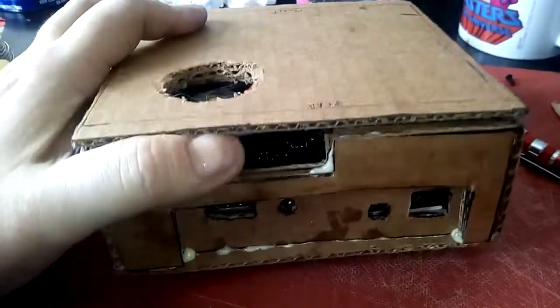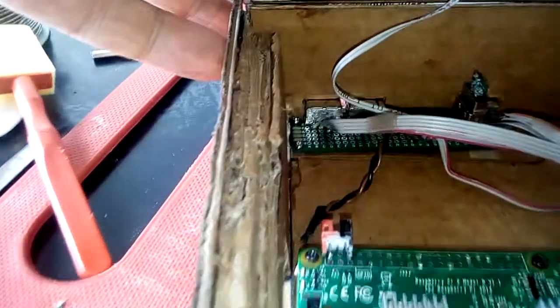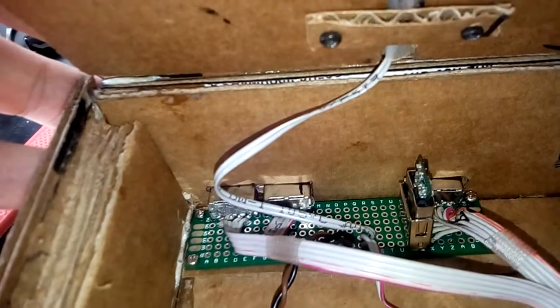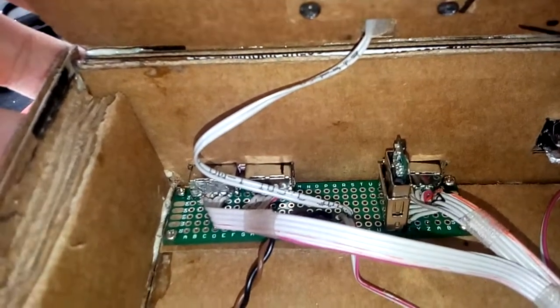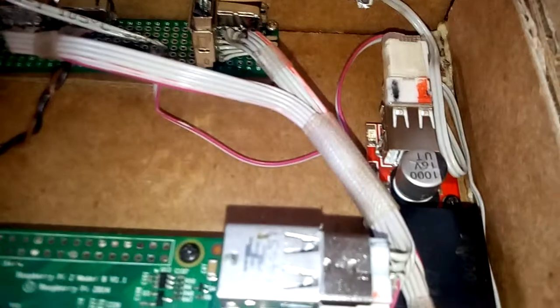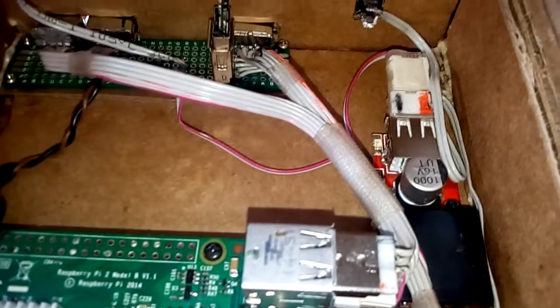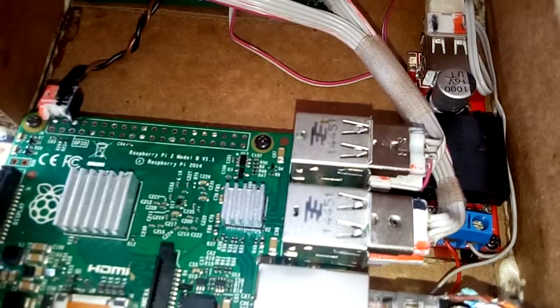I cut out the vent here. The reason being is there's a laptop fan in here, and down here is my main board that I wired. The main board has USB extensions — just ribbons going straight into extensions. There's one that stood off — that's a USB Wi-Fi adapter I just got in there. The back of the switch, that red board there, that's the power converter board. It's taking 12 volts input at 1 amp and converting it to about 5 volts at about 3 amps.